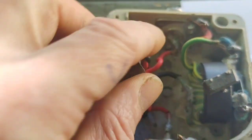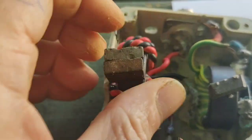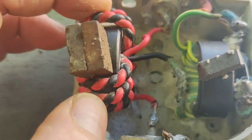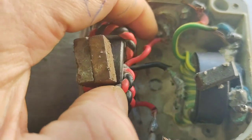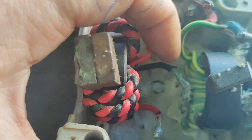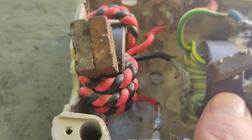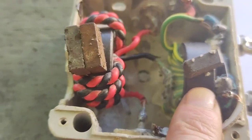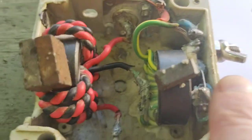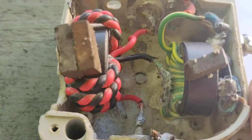So you have to play with your values with the magnets. On the output side of the twisted pair — the far end — take the black wire and run it across to another inductor of the same core value, and that takes nine turns across to ground.